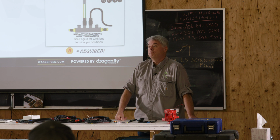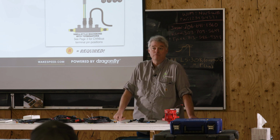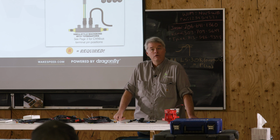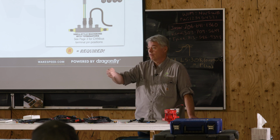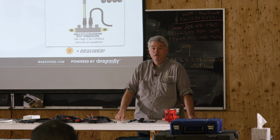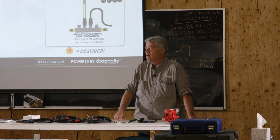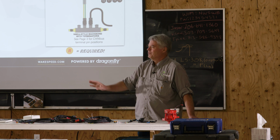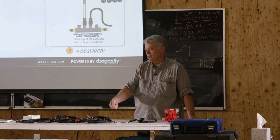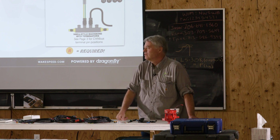Now, there's much more advanced options. We have some configurations where you actually have the system running 7/24, where the regulator is always powered on, and you end up putting the ignition into that. That's how the regulator knows if the engine's running or not. So there are more advanced features with it, but I think the two most common are BMS integration with some BMSs, and then, and I only see this in the marine world, where the operator wants a toggle switch. They can say, I want less power out of that.